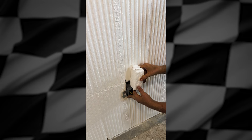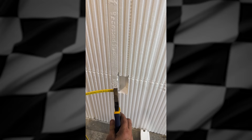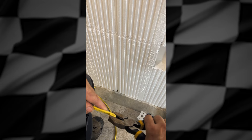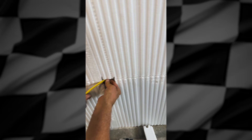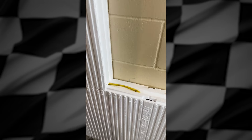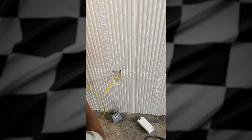One trick for sliding wire in easily so it doesn't get hung up is to take and bend over the end so it doesn't have any sharp thing to catch on. Now it has a smooth transition and it's not going to get hung up. When you go to put it in and run your horizontal, you can run eight or ten feet without any need for a fish tape — you can just shove it through from box to box, no problem. Same thing with the vertical.